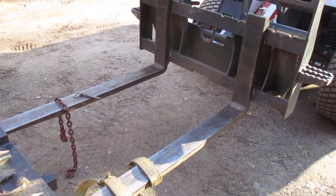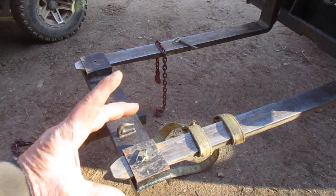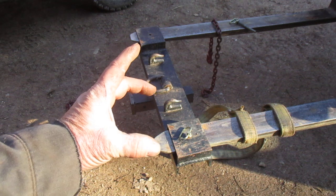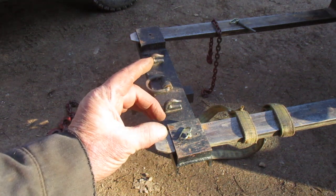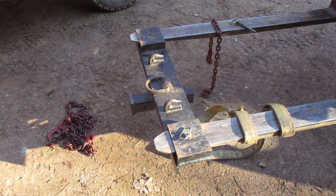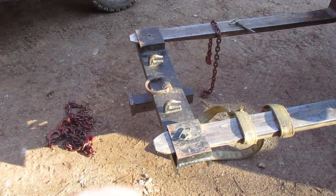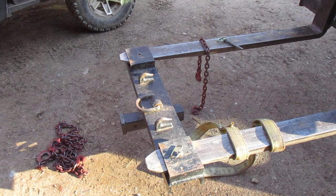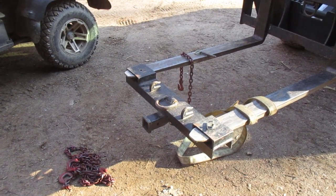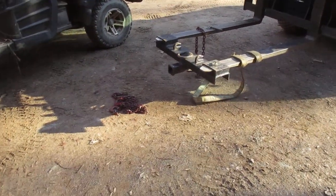Once you start getting back out of the guide or funnel area of your forks, I tend to agree with them on that. Even in the guide area, if you have over a certain length hole - maybe they should change the regulations and say you can have a half-inch hole in a four-inch-wide fork, regulating the hole size depending on the width of the fork. Maybe it has to be a drilled hole as opposed to a torch-cut hole. I think when they go to a job site it's easier to just say no holes period - it doesn't mean it's unsafe, it's just how they control it.